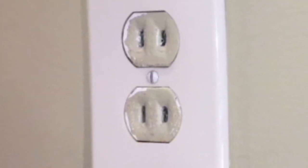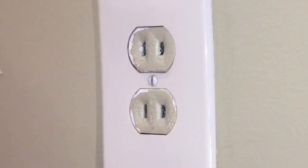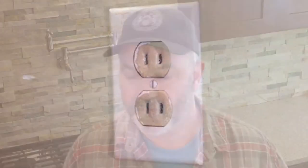In my case my outlet is old — 60 plus years old, it's original to the house, and it's just a two-prong outlet. Obviously today you need that third prong for any appliances or even a laptop or computer that requires a ground. So I'm going to go ahead and take out the old outlet and replace it with a proper outlet that incorporates a ground.